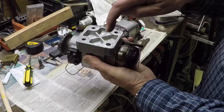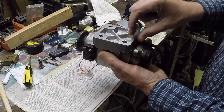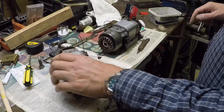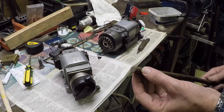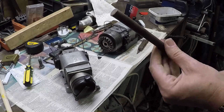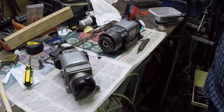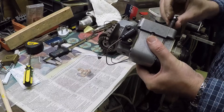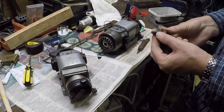I'm planning to machine up an insert to go in there — basically drill to the tapping size for half-inch Whitworth, then thread it half-inch Whitworth and put a steel insert in. I don't particularly like using aluminium; there's hardly any weight difference using a little piece of steel and it'll have a much stronger thread. This is a piece of EN8 which was lurking around under the bench — EN8 is a really good general-purpose workshop steel. The bolts that normally go in here are three-eighths by sixteen, which is effectively a three-eighths Whitworth, so the tapping size for that is five-sixteenths.